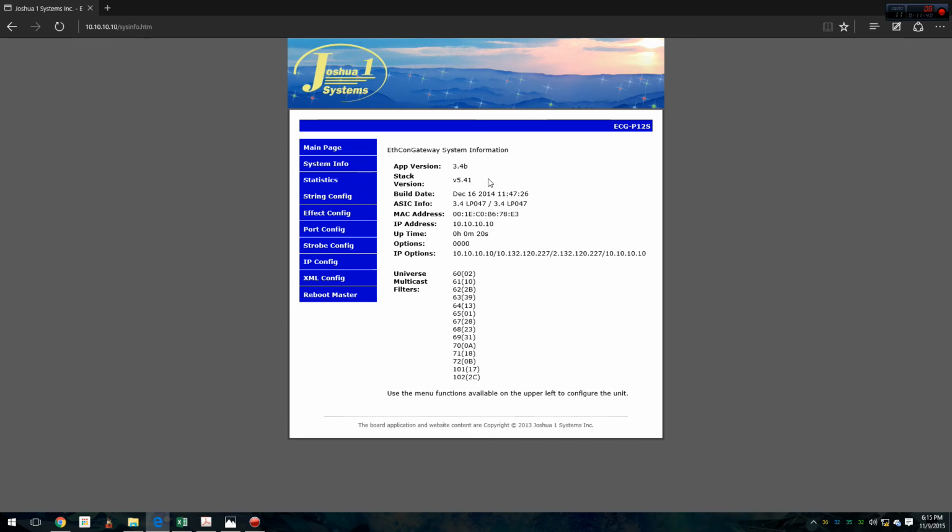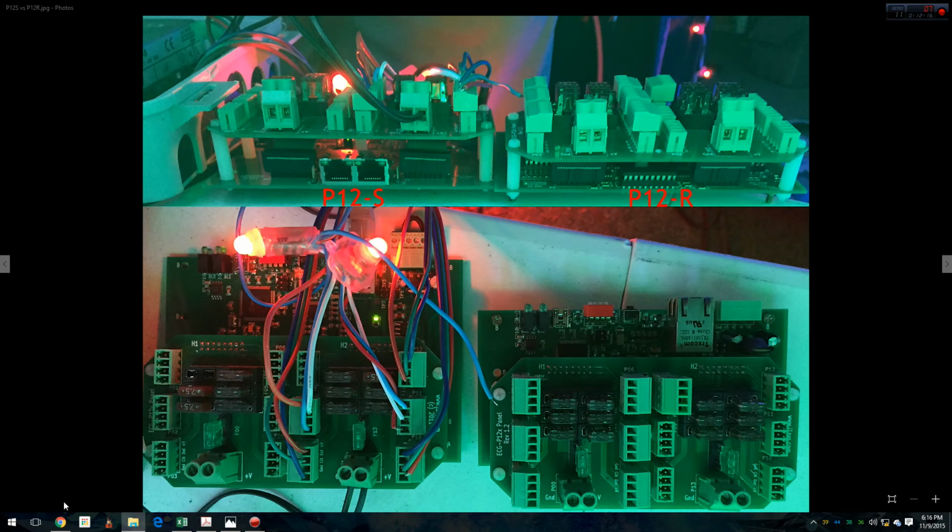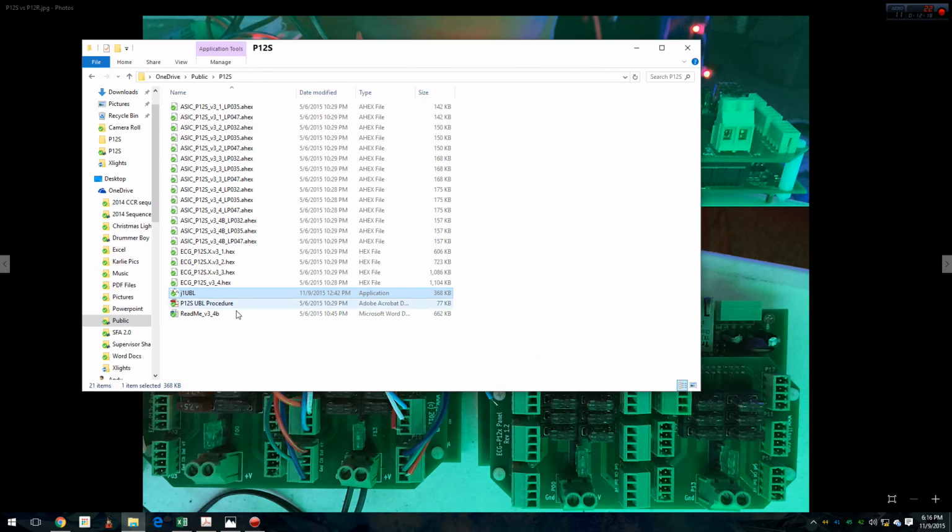Now, this worked out really well, too, because it's still doing the craziness. I probably should have put a camera out here so you could see what's going on, but you can't, so it's still doing randomness. So I'm going to roll this thing back to version 3.4 versus 3.4B, because 3.4B is not working correctly on my particular board. I've seen other people say it worked fine for theirs, didn't work for mine, so I'm going to roll it back to 3.4. So in order for me to do that, I'm going to close this. I am going to open up the UBL, so back to the files. Go back to the UBL,